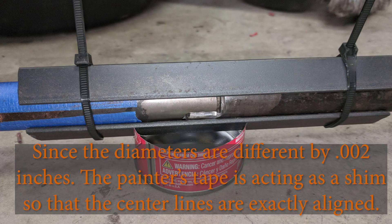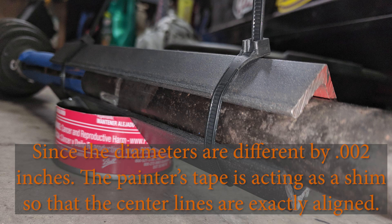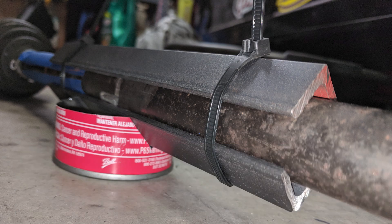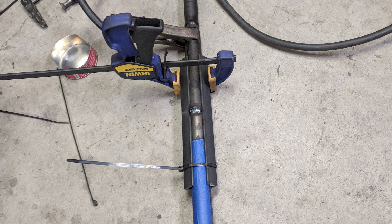To make sure that we have it all straight, we're using a piece of angle iron here. I use zip ties to hold it in place, but what would have been better — because it's obviously welding metal — would have been using hose clamps. I cut an old can from a brake cleaner can just to prop it up while I made some tack welds on the side. Now you want to make sure you don't overheat this, but you also want to make sure you get enough heat penetration on there as well. You don't want to warp or distort anything.